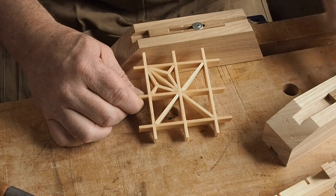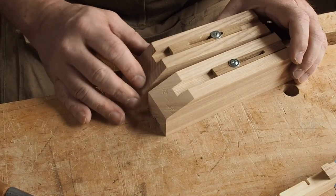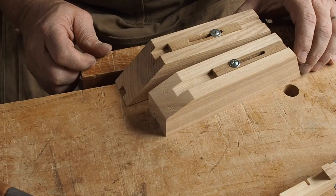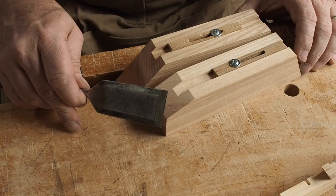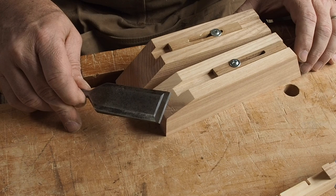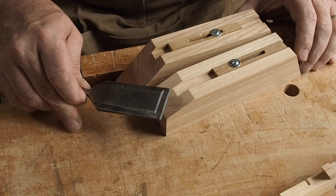The way I go about doing that is with a pair of blocks. This is the method I use — there are a lot of different methods. I use a short chisel, nice and sharp, to cut each piece both to the correct length while beveling the ends at the correct angle.